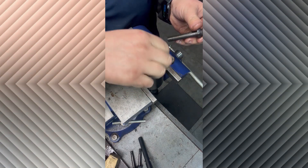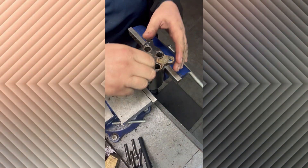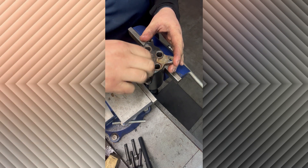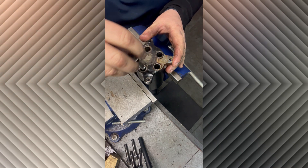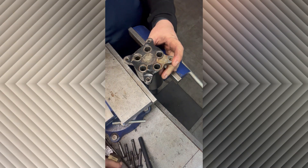It's really important to mark this little steering motor when you're taking it apart. I usually use a paint marker and do like an upside down V so that when it's going back together all of the sections go back together nice and smooth and those bolts go right down.